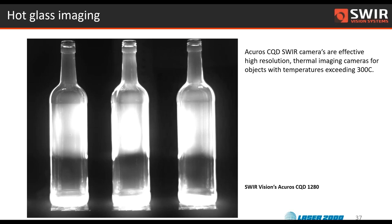This is an image of hot glass — here you're not using reflected light but emitted light, thermal photons coming from glass at 300–400 degrees Celsius, using different intensities of light to get information about the quality of the glass just produced. We have a video of these hot glass bottles coming out of a furnace on our website where you can see the same kind of imagery in real time at video rate. High-temperature, high-speed thermal imaging is a really good fit for this technology — one where many other technologies, like traditional bolometers, really struggle with the high-speed triggerable part of a camera system.